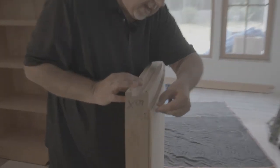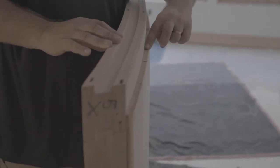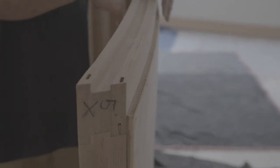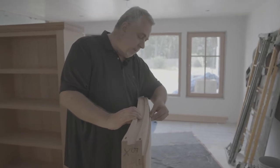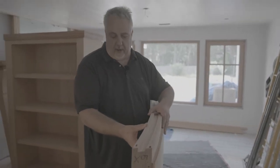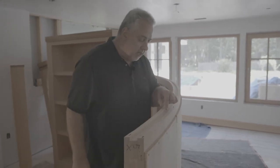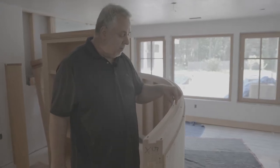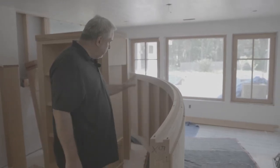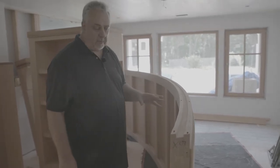On the backside here, you can see we had that bendable fir panel — you can see how it has all the curves. They literally built a curved template to spec and then pressed and glued that bendable panel on the back of the frame. That's how they made this up. This is a series of glue-ups where we have two pieces of five-quarter and finish it with a piece of one-by material, making for a nice contemporary frame with our nice radius that we spec'd out.